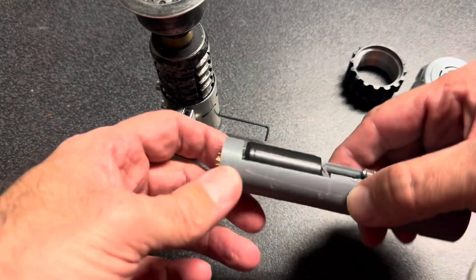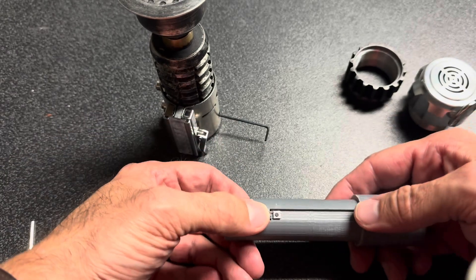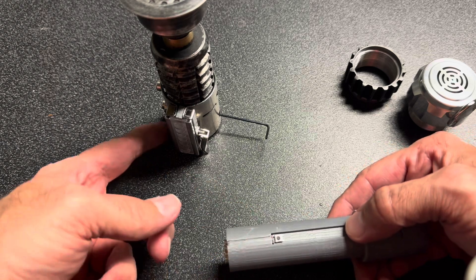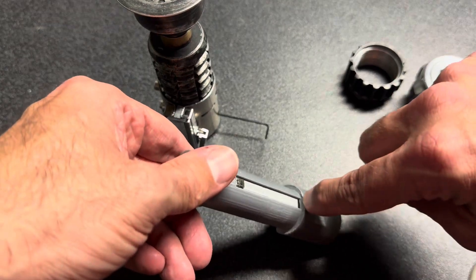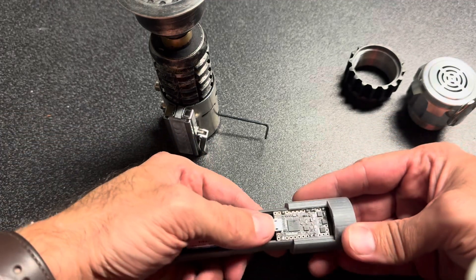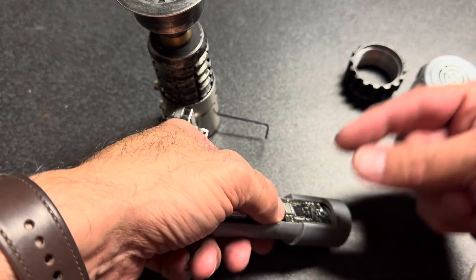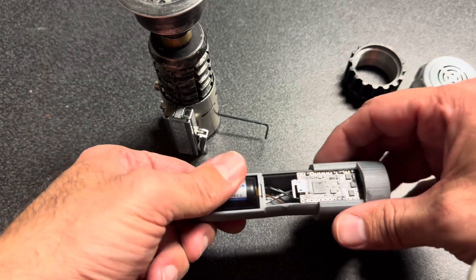You have an 18350 battery and a stock connector. If you do want to add a second button, you drill a hole in the clamp card on the back end, carry that hole through the grenade, and mark it here — you can add the extra switch wire hole right here, then solder it straight to the board. The board does have some E6000 on it; pull it forward and start tilting it up with the battery out and the board will come out. Those two lips will not prevent it from lifting upward out of the chassis.